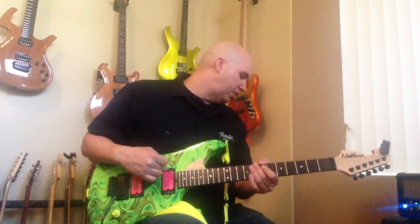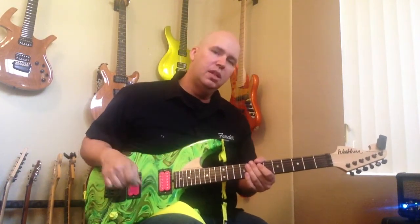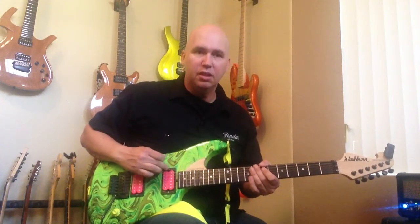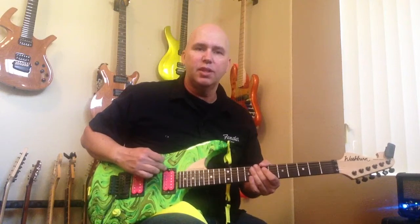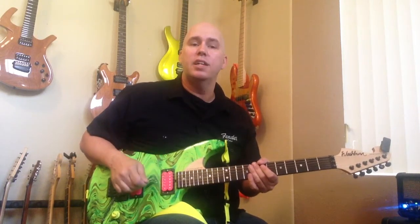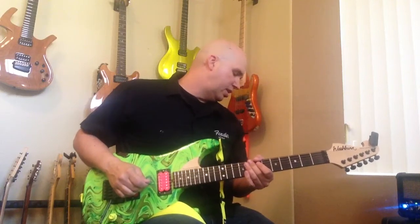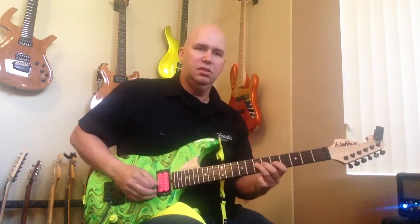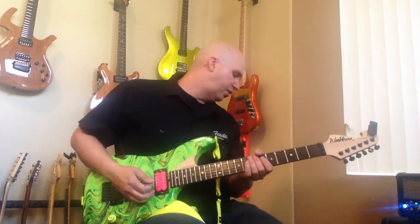Here's the issue though — I'm going to slap on a distortion box. In the single coil mode you can hear the 60-cycle hum. Very subtle. I'll try to make it even louder — there it is, there it's off, that's humbucker. Now single coil, out of phase. So the out of phase is noiseless, and you have a super coil, which is really nice for some overdrive.